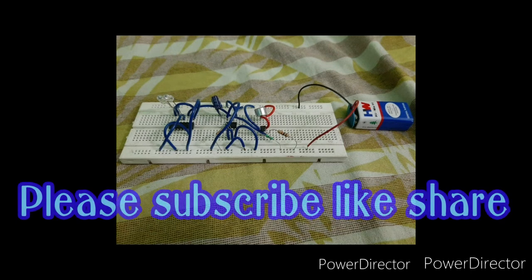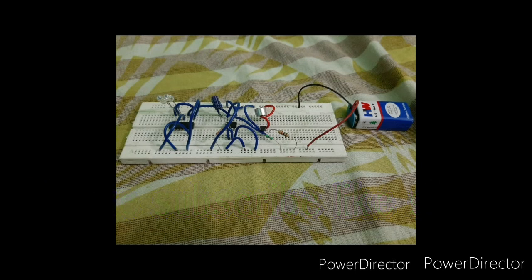And this is the main concept of the clock pulse, meaning until the next clap sound. So this is the clap switch which will turn on with the first clap and turn off with the second clap. If we remove the D-type flip-flop from the circuit, the LED will turn off automatically.